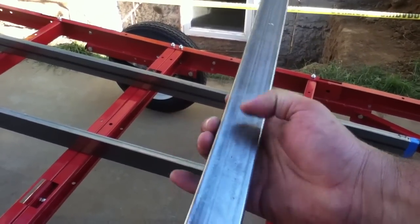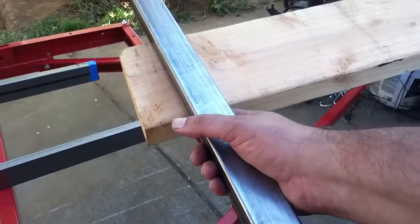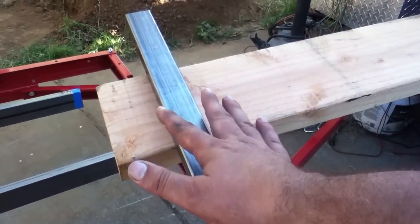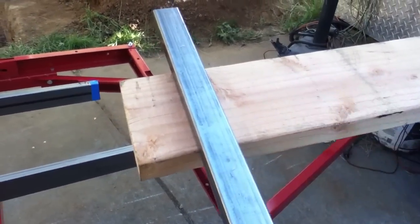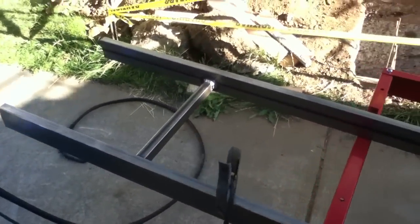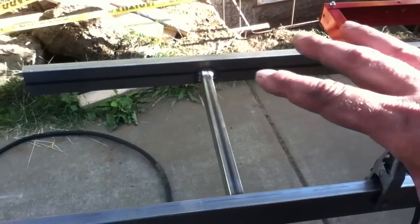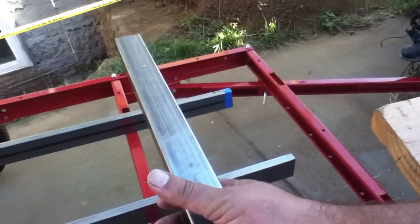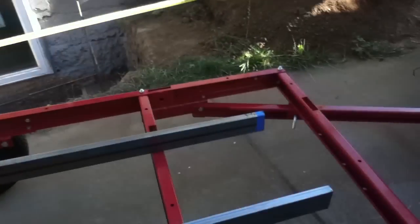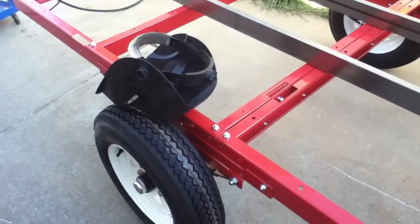When I use this for reinforcement, I can orient it either way — oriented one way it has a little more bridging strength; oriented the other way, I have a surface area equal to the edge of a two-by-four or two-by-six for getting edges of plywood up against each other with enough screw bite to join them. On this first cross member where I know there won't be plywood edges meeting, I've welded it flat. I need this to hold parallel while sliding things and getting it welded, so it had to go in that way.